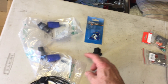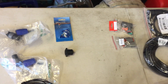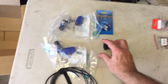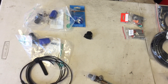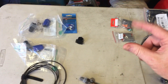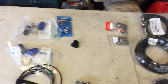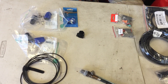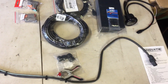I've bought some six-way Deutsch connectors to extend the sensor lead as needed. For power, I bought a Neutrik Speakon NL4 connector and some Speakon plugs which I'll mount on the side of the box. That gives me options — either connect via cigarette lighter, fly leads with clamps, or in the Land Rover I often work on there are banana connectors inside the cabin. So I'm leaving myself a number of options for connecting 12 volts to it.